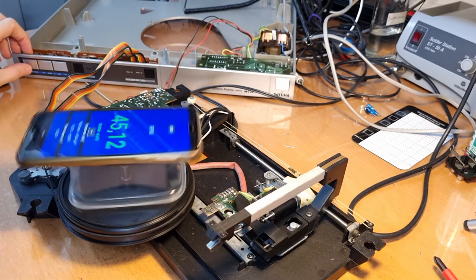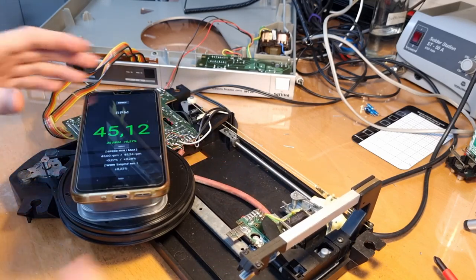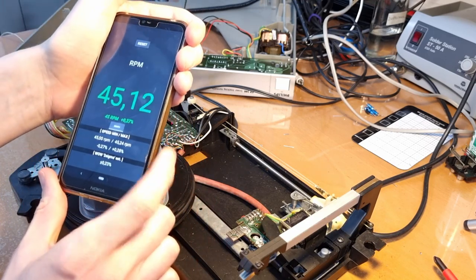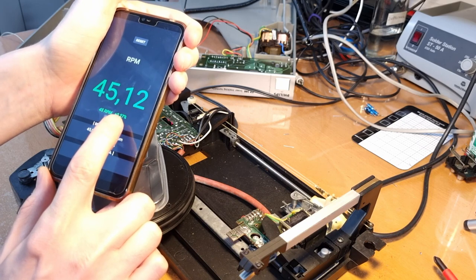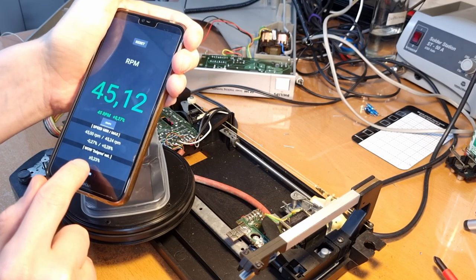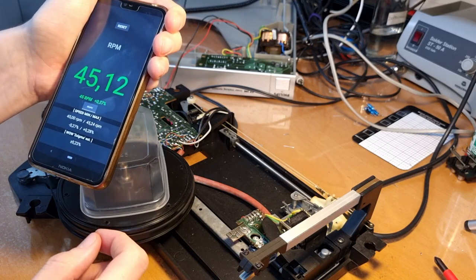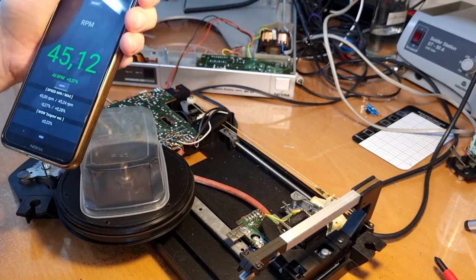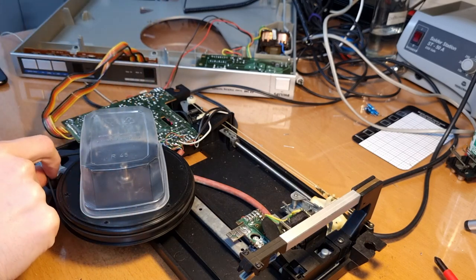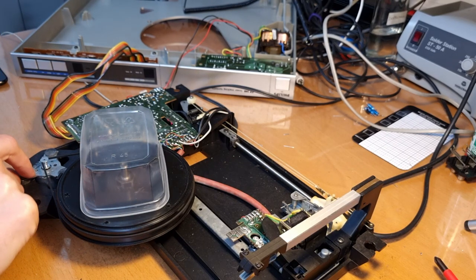Okay, let's stop the record player again. And we got 45 RPM plus 0.2% or 3%, that's really good. The wow is 0.23%. That's not fantastic, but hey. I don't think I can do much about that. Only maybe the belt, but the belt has been changed recently. Maybe cleaning the motor or something, but...